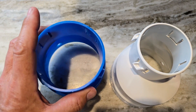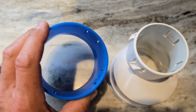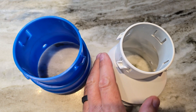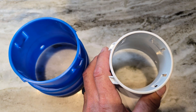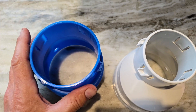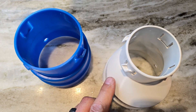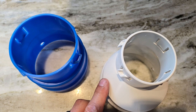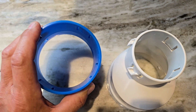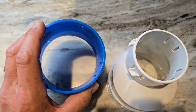This pipe needs to be for main trunk lines. When you're running a roof runoff system and you're tying say three, four, five downspouts on three inch pipe, you run it to a four inch trunk line. These three inch branch lines will stay nice and clean. By the time you get all that water to this trunk line, you now have enough water to keep this larger diameter pipe clean.